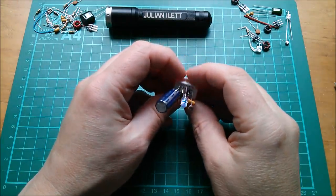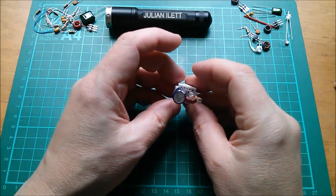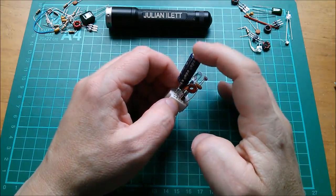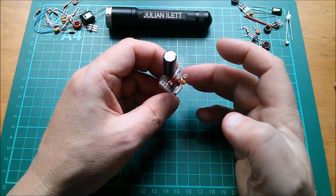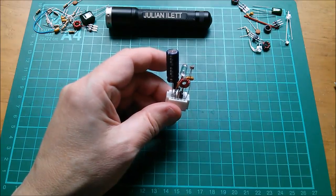That super cap has almost completely gone out — I think I underestimated the size of super capacitor needed. I should have done the calculation: half CV² for the stored energy, then watt-seconds for the energy the circuit uses over a defined period. I could have done that.